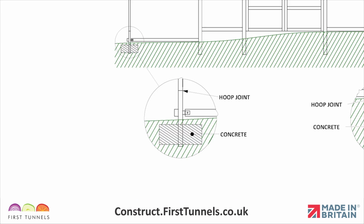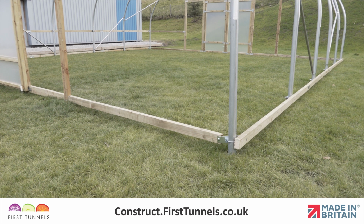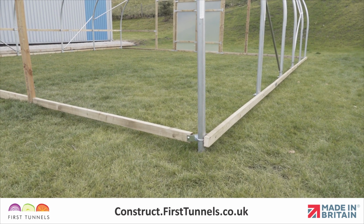If you have a slope across the width, fitting the rail on this joint will create an unnecessary gap. We advise setting the base rail at a height that eliminates the gap as much as possible, but still ensuring that the rail from the doorpost to the corner hoop is level. Ensure that the rail is at a consistent height. A string line will be handy here.